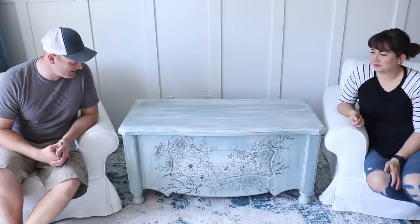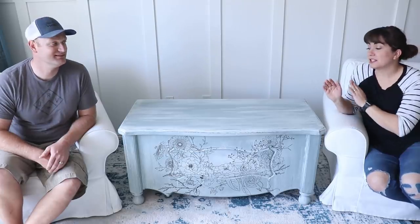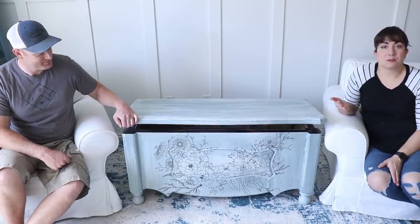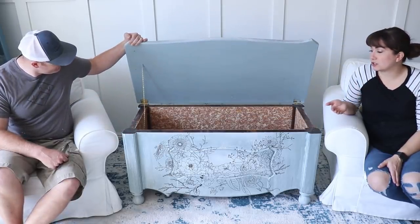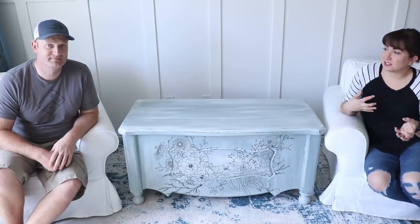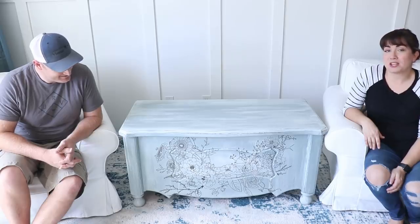I like the white wash on it quite a bit. This is a great option if you don't have white wax, or if you're looking to put a liquid top coat as the final coat — because you cannot put liquid over the top of wax. We get this question a lot, and I thought it would be a good opportunity to show you how you can just water down your leftover paint, create a wash, and you can use any color. You could do this in brown for kind of a glaze effect — the sky's the limit. Be sure to go to jamierayvintage.com. We used DIY paint in Skeleton Key and White Swan, synthetic brushes from Paint Pixie, and the IOD Winter Song transfer. Give us a thumbs up and subscribe to Jamie Ray Vintage for more DIY.